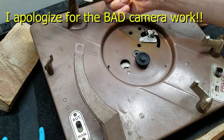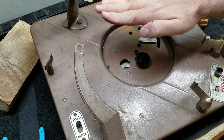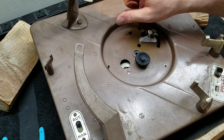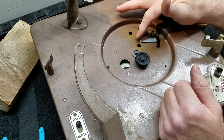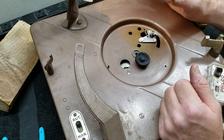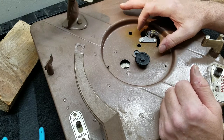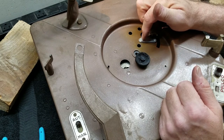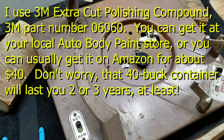This little top leaf here will keep records above the bottom one from falling down. Remember, the stack is sitting here and you want the bottom record to drop down. The thicker leaf will push that record over a little bit and drop it down, and this leaf keeps the rest of them from dropping down. I've already cleaned and lubricated this part. I'm going to clean this spot and lubricate it a bit - very small amount, because on the side where the drive is, I don't want a lot of lubrication near the idler wheel - it's got to stay dry. I'll worry about lubricating the spindle bearing later. Cleaning and polishing takes a long time, so I'm going to do that off camera.